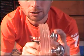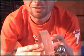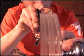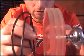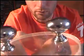Take it to your machinist or engineer and get them to cut two o-ring slots, preferably a little bit further apart than what I have done on mine. Make sure when you take it to them you take the o-rings and the bit that's going into the pipe so they can machine it correctly so it's a nice perfect snug fit.